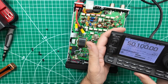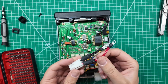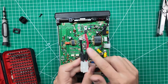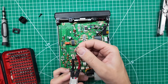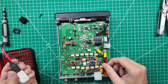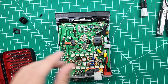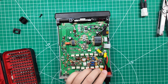Ta-da! Working good! Now you might notice the original connector came with two wires terminated into a ring terminal through a little bit of ferrite — definitely not a fuse. It uses thicker gauge wire. What they're doing is using two wires to handle the amperage going from the connector through to the radio. We're replacing that with one wire to get the job done. I'll double-check these connections — they look good. Take the power pole cable and verify it fits in there nice and good — and it does.